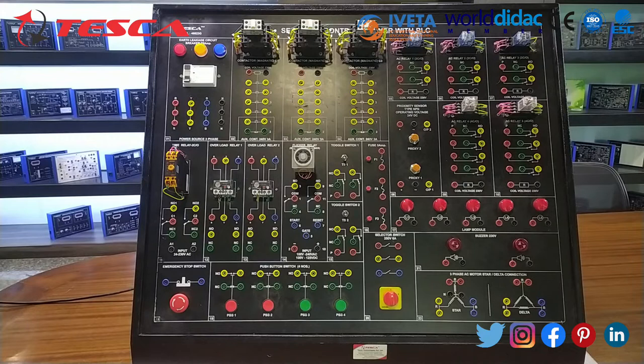Let's move on to the procedure. Step 1: take RYB from the supply and give it to the contactor. Step 2: from the contactor output, give the supply to the overload relay.